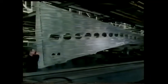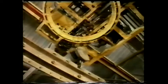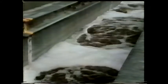Part of the wing skin of an aeroplane - it's another aluminium alloy, and it has to be strengthened by stringers which are joined on by an adhesive. The surface must be prepared first before the adhesive can be applied; this is another very important factor that affects the efficiency of the bond. The skin is immersed in a tank of very strong detergent solution. The contents of the tank are agitated to keep the solution moving over the surface; the detergent removes any grease that may be present. The skin is left in this solution for about 30 minutes.